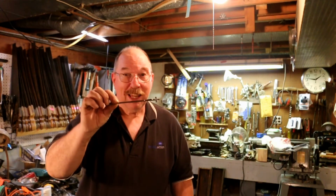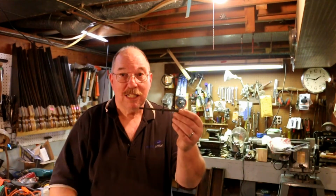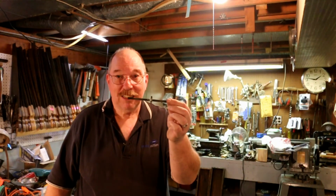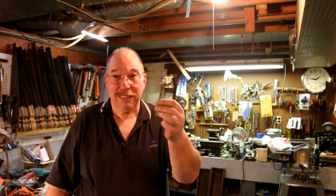I'm pleased with the caster mounting. Also, I'm pleased to be able to use some of the tools that I just recently picked up. This little scale, that's one in the box 2 of the Harbor Freight boxes. It was in pretty sad shape, all rusty, you couldn't read the numbers. A little bit of Scotch-Brite and some 1200 grit silicon carbide sandpaper shined it right up. Works quite nice. Little wax, now I got a scale. I used it to center up the casters.